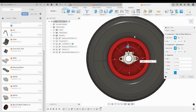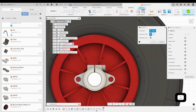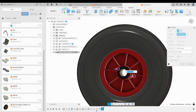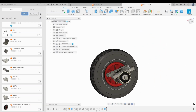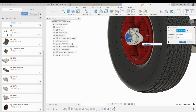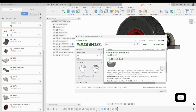Once the part is modified, we mount it onto the shaft and secure it with the M5 grub screws. Next, the go-kart wheel needs to be attached to the shaft. The wheel has the same size as the front ones, 260 mm. I mount it as follows. First, I drilled two holes into the wheel at a spacing that allows me to connect it with an SK20 coupling. So right behind the gearbox I place a coupling, then the wheel.